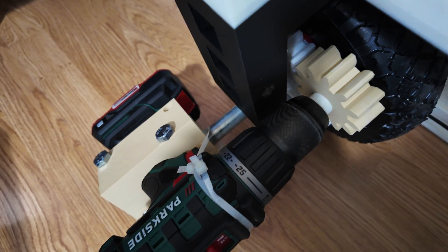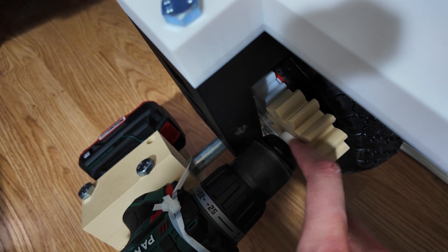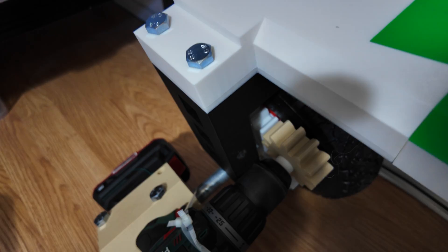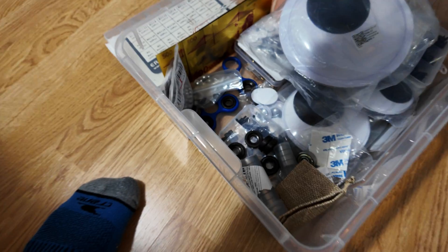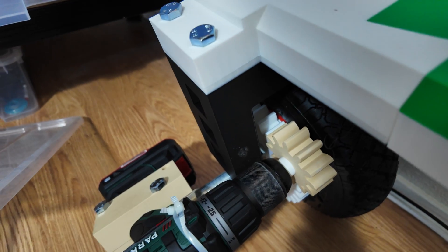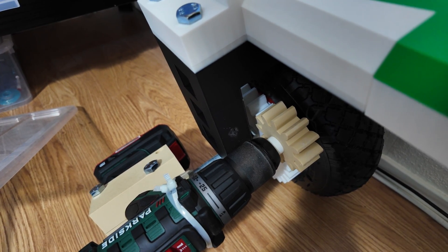What I want to try is have a little rod between this axis and the axis down here, and we need a sort of bearing right here. Then the gear can almost not slip anymore because the rod is pulling these two axes together. I do have some bearings from other projects. The hole in the middle is 8 millimeters, but this axis is 10 millimeters, so we've got to do some work with the angle grinder.